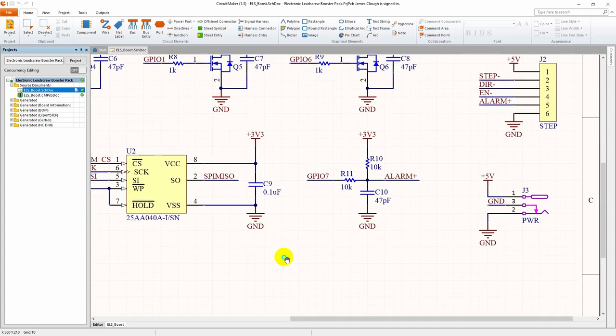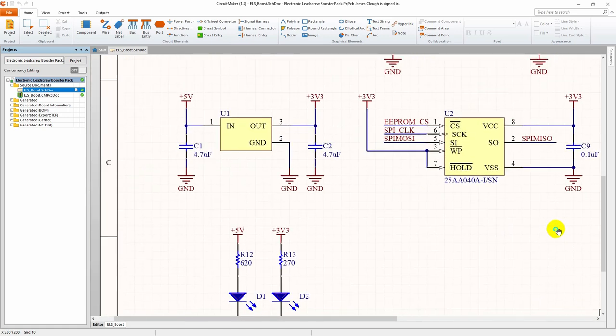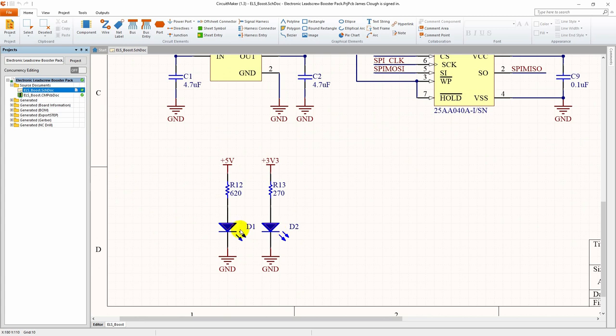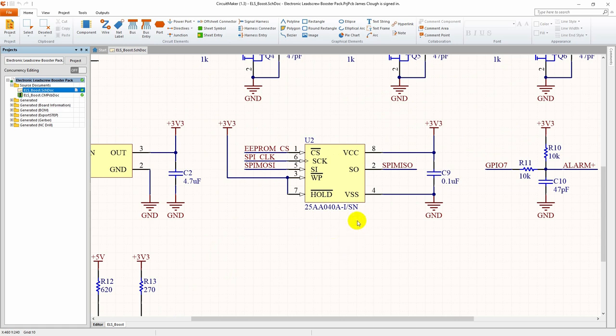I've also decided to put power on this board as well. We'll feed in power through a barrel connector, and I've got a voltage regulator that will take the 5 volts from the external power supply and provide the regulated 3.3 volts needed for the microcontroller. I've got a couple of LEDs to show the status of the power. This microcontroller does not have erasable non-volatile memory for storing settings, so I went ahead and put an EEPROM chip in here as well. These are really inexpensive at about 40 cents at volume — if we don't end up using it, I just leave that part of the board unpopulated.